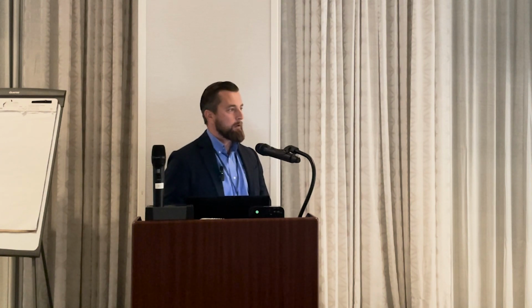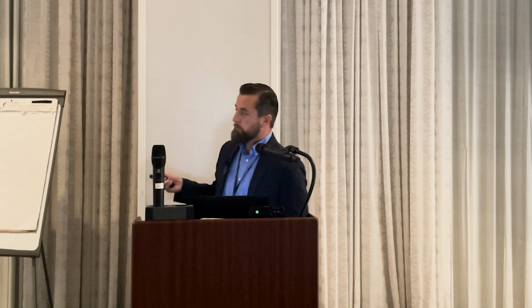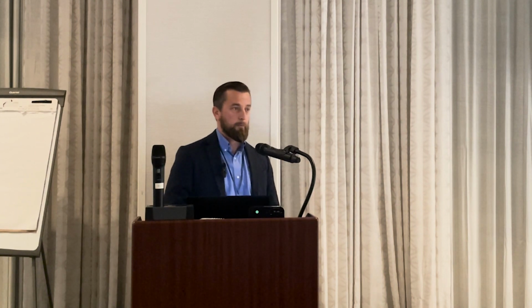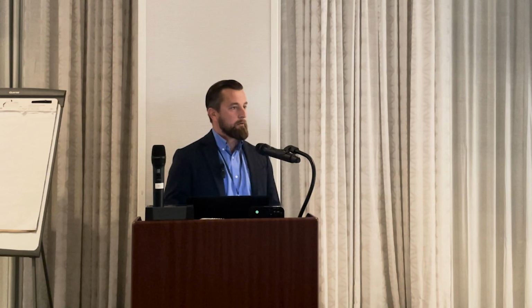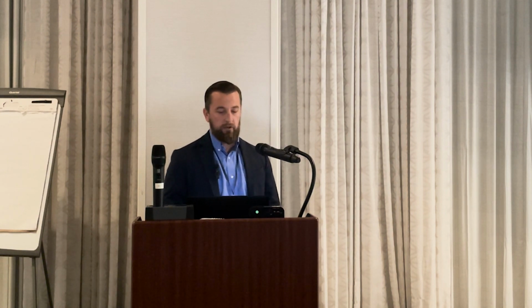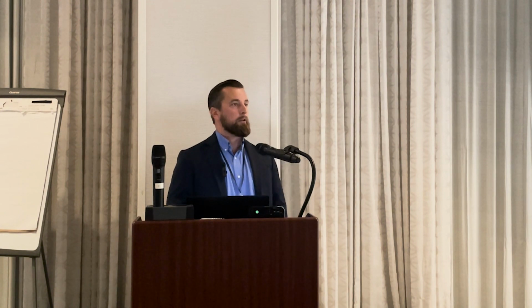Also, a little known secret, there is no ASTM or ASME standard that we use in the industry that says you have to build a flange like that. So that's on you guys right now until we fix that. We're working on fixing it, but it's on you guys to make sure that you're specifying how flanges are to be made. Otherwise, you can just get flanges that are made really quick and they look great on the outside, and once it's made, you can't do anything about it.